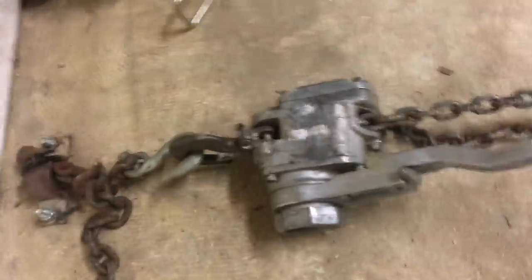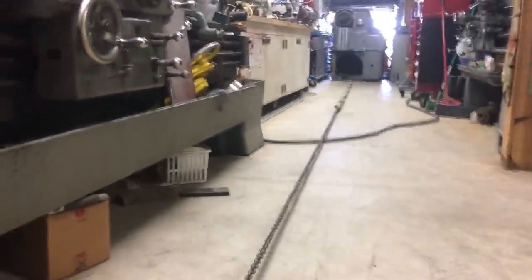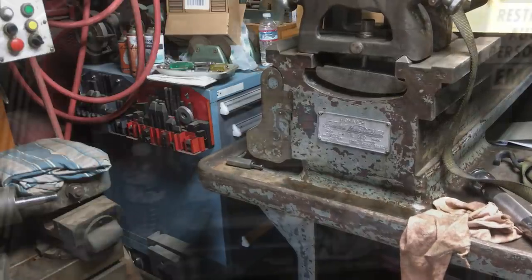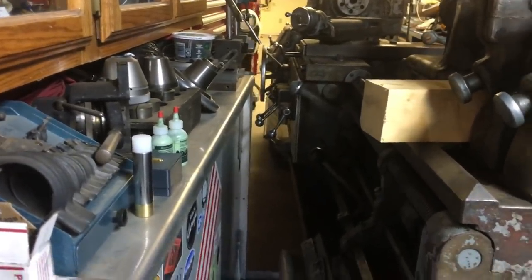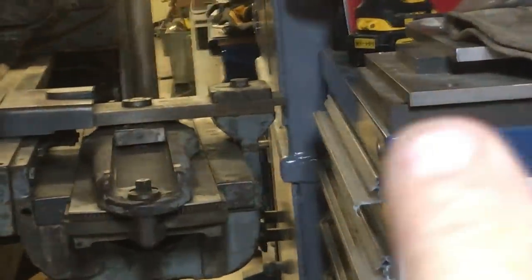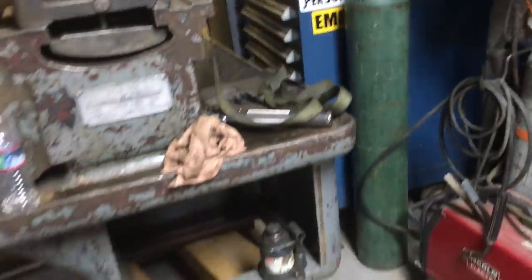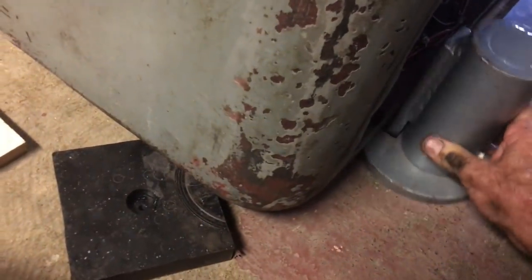Here I'm showing the anchor point — it's got a couple of half-inch lags going down into the concrete, just for pulling off of. This shows a little bit better as far as the view on the clearance — those will barely clear, and I almost thought I was going to have to pull the taper attachment off. Those are extremely heavy on the Monarch, so I was hoping I could snake it through there without removing it, which I was able to. I used the come-along until I got it safely onto the upper deck, then switched over to the electric winch.